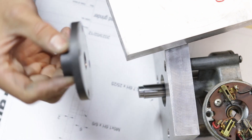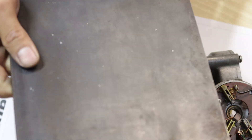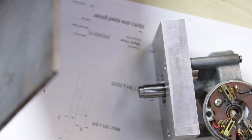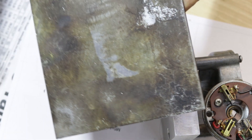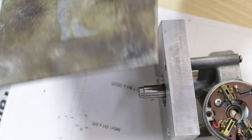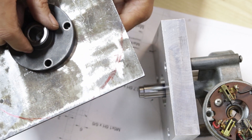but as you can see, having a flange already ready-made for me allows me to make a separate platen out of some 5mm mild steel, or maybe this convenient but dirty plate of 3mm mild steel. I think adding these two together and mating them up should actually work quite nicely — that'll save me a lot of time. Let's get to that.